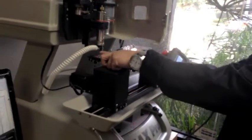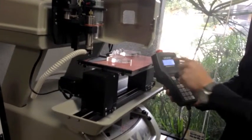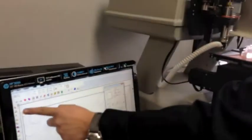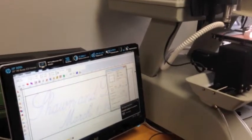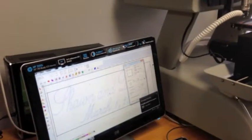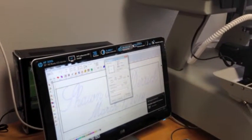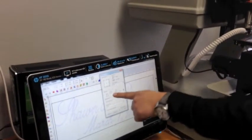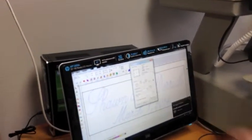Okay. Notice it went here, and that my X and Y position are now 0, 0. The home on our system, when you're engraving flat, is always the upper left-hand corner. That's the 0, 0 point, right? And our design starts wherever you've set home. So if I click OK, one thing the measure feature does is it sets our custom home with the machine, and two, it calculates the plate size and adjusts it accordingly in the software.